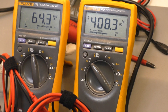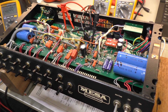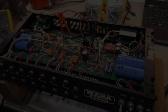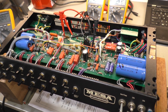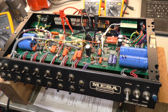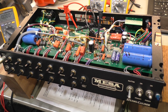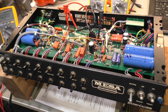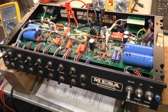It's still a bit high for comfort, but it's still got the original valves in there. So if it presents issues in the future, we might be able to put some Sovtek EL84Ms in there - their data sheet actually specs a maximum of 400 volts, so we'd be a lot closer to that. We're going to see how it goes with the stock valves sitting at just over 400. It's a bit awkward at the moment - we can't sit down in the shop and try it out like we normally do because of COVID. We're actually under lockdown, have been since mid-June, and probably will be for the rest of the year. So he's going to have to take it home and have a feel and get back in touch with me if he wants any further changes, but I think he should be reasonably happy.